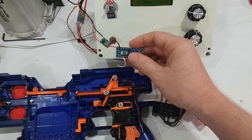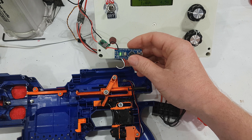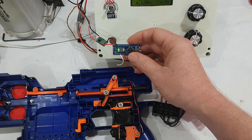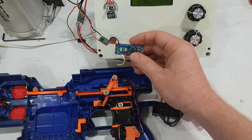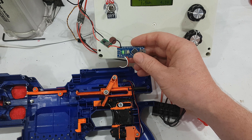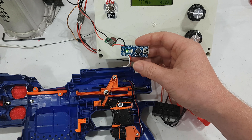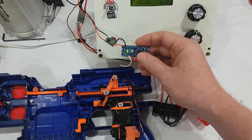Before I was talking about how the braking was increasing the voltage and that could cause problems. Well, even without that kind of boost, it wrecks the Arduinos. I used to apply 16 to 20 volts into them and they didn't blow up. Now I can't even apply 12.5. Looking on the forums, the specifications say you can apply up to 20 volts, and yet at least this batch of Arduinos blow up. It seems that in version 3, cost cutting has meant that they really can't take anything more than 12 volts, and some are saying up to 9 volts.